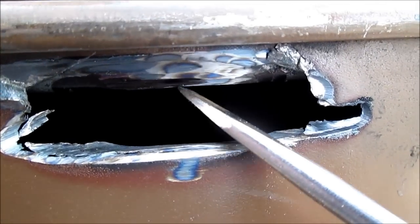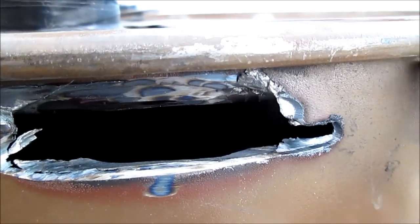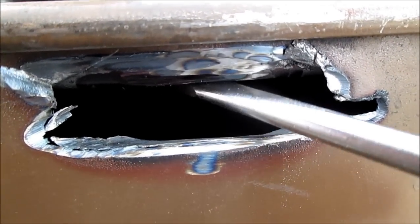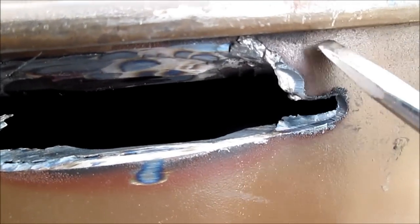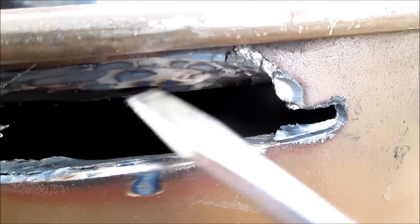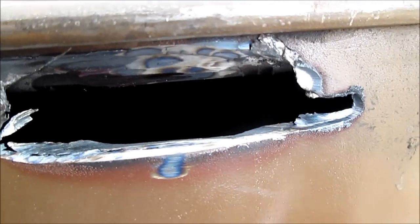Okay, this is that lip. This is your inside lip right here. It's about 3/4 inch down. So we'll scribe that. We'll use one of our caliper tools or whatever you've got, you can scribe. This is the lip. So we're going to cut here and we'll grind this barrel off, that way we have it in our hands. We're not messing with it on here. We just want to get the top cut off, because we're going to shorten the barrel. So we're only wasting an inch of metal here, and the rest of you use the scrap.